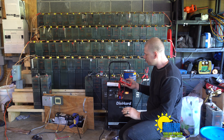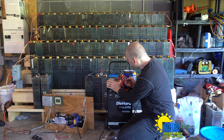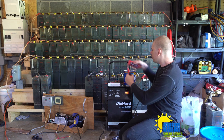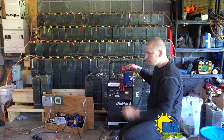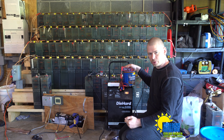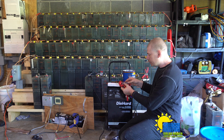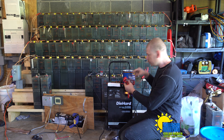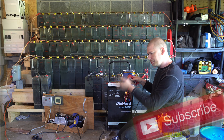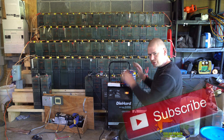This specific battery I was able to recover. We are currently discharging it at two amps and we've gotten about one amp hour out of it at around eight volts. At this point it's capable of discharging and recharging over a period of time — assuming it continues to go well.